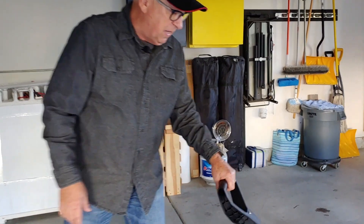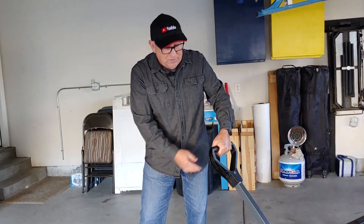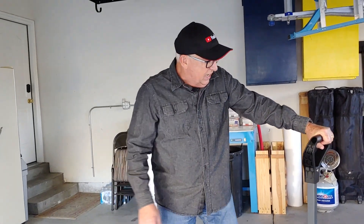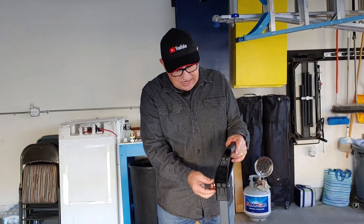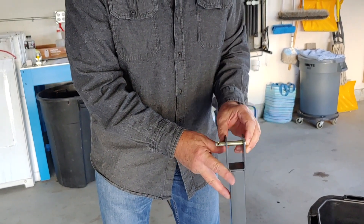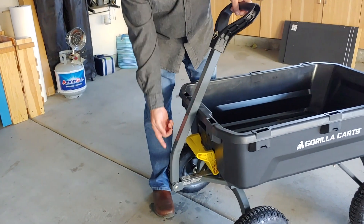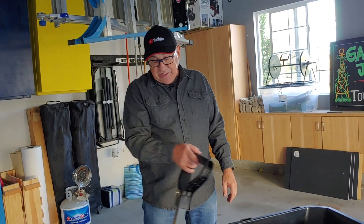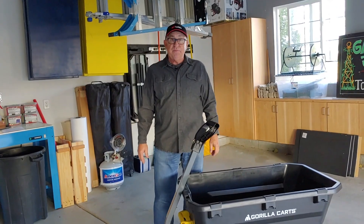The handle design is beautiful. The size of the yoke is really nice — if you need to put two hands on it and pull a heavy load it works great, but it also fits well in one hand and feels very comfortable. It's easy to convert from the pull handle to tractor attachment by simply removing the quick pin, pulling back the handle, and letting it drop — then reinsert the pin. Make sure when you put the handle tube in that the bend goes back over the top of the poly tub, so it lays correctly and stows without falling down into the dirt.